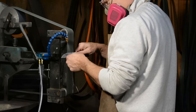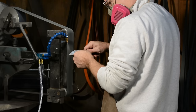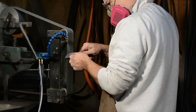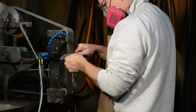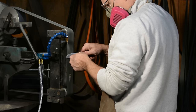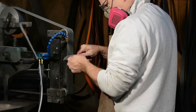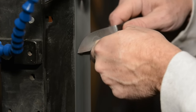Are there trade-offs? Yep. No matter what they say, it is messy. I don't normally wear an apron in my shop because I dress like crap — I'm one of those guys where fashion comes to die — but even for a guy like me, this throws off excessive amounts of moisture on your clothes. You just get kind of wet and clammy, so you've got to wear an apron. That said, it's not as messy as you might expect. It doesn't sling liquid off the belt into your face or onto the wall behind the grinder. It does throw a little bit under the grinder, but all in all, not too bad.